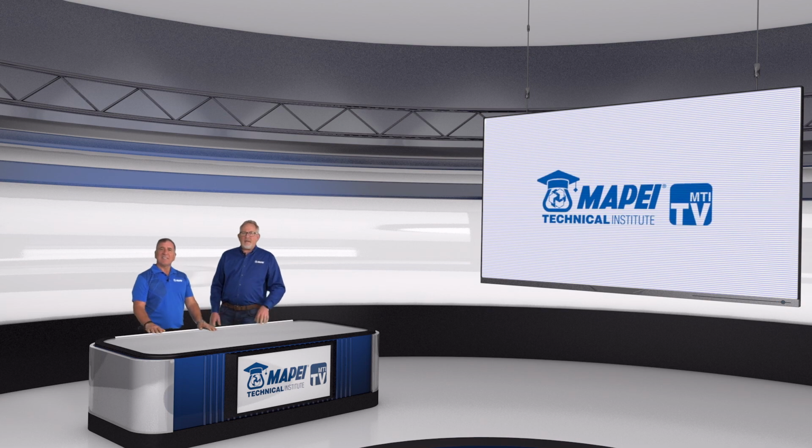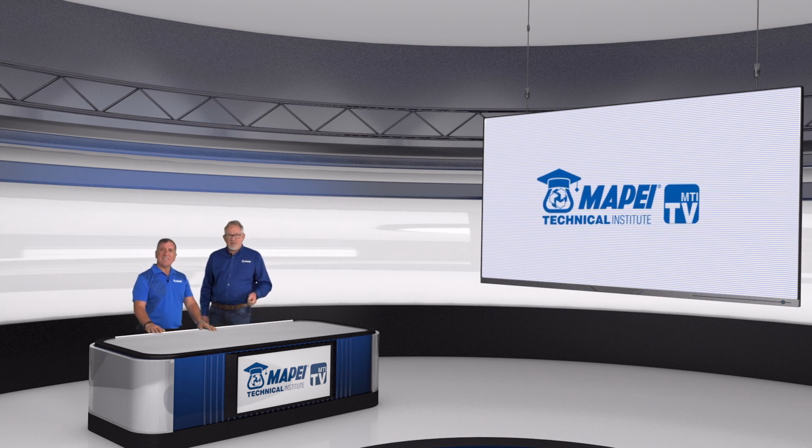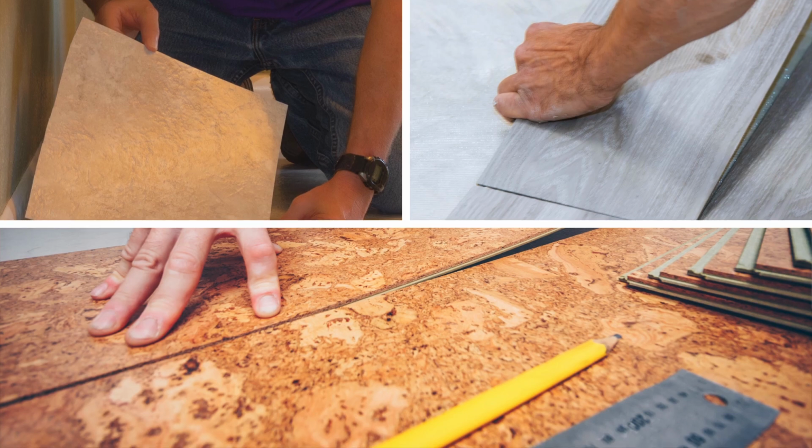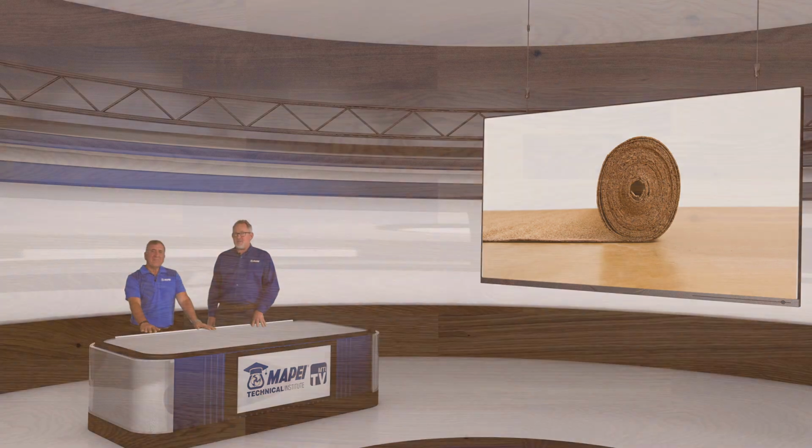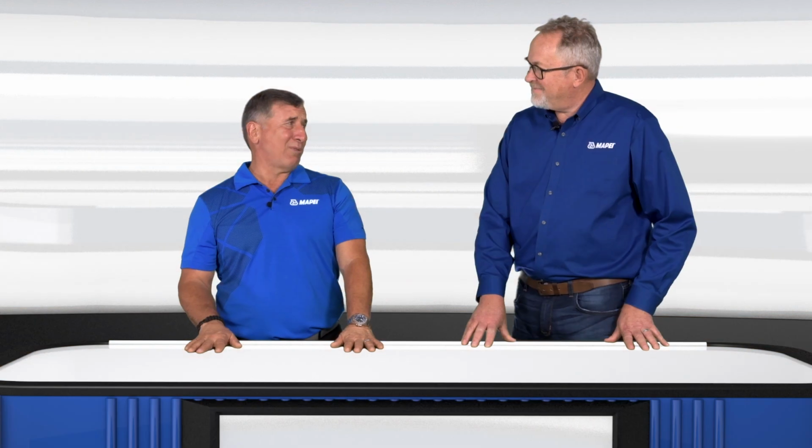And what type of products can be installed on top of these tapes? Well, MAPEI Contact MRT can be used to install vinyl sheet and tile, vinyl plank, cork flooring, and cork underlayments. And MAPEI Contact SRT? Nearly the same list, plus MAPEI Contact SRT can be used to install pre-finished wood flooring and bamboo.